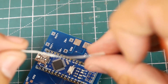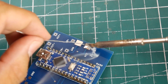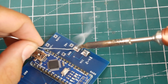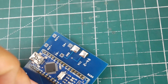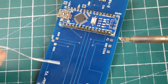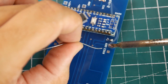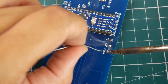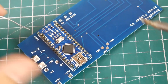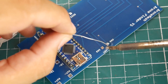This is where the XT60 is going to be connected — to this pad right here. Let's add some solder. I made sure these pads are pretty big and well spaced apart, so if you don't have much experience, this should be pretty simple. Then we're going to do these pads as well — these are for the antenna, routing it all the way to the other side.